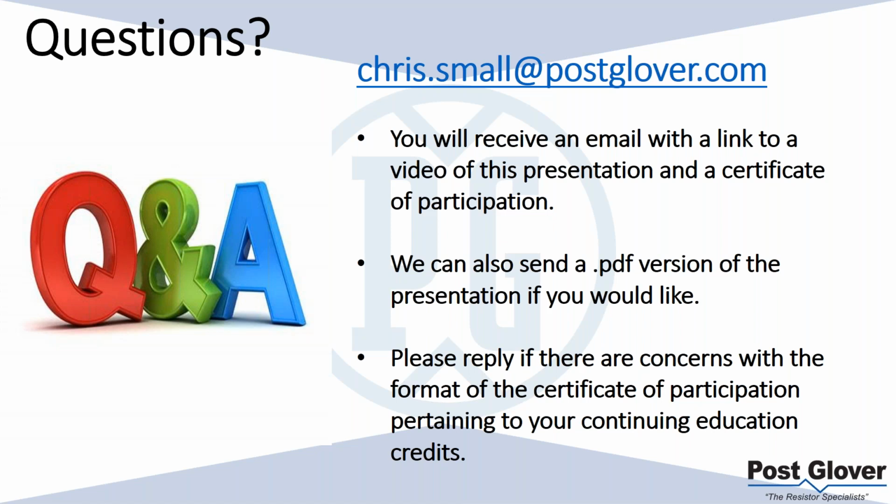The second question that we'll be taking in the open forum part is regarding the resistor grounding: what is the significance of the time rating? I often see NGRs referred to as X amps for Y seconds and Z amps continuously. Could you help us understand these values better? Explain the significance of a 10 second rating or a continuous rating or other possible time ratings on resistors.